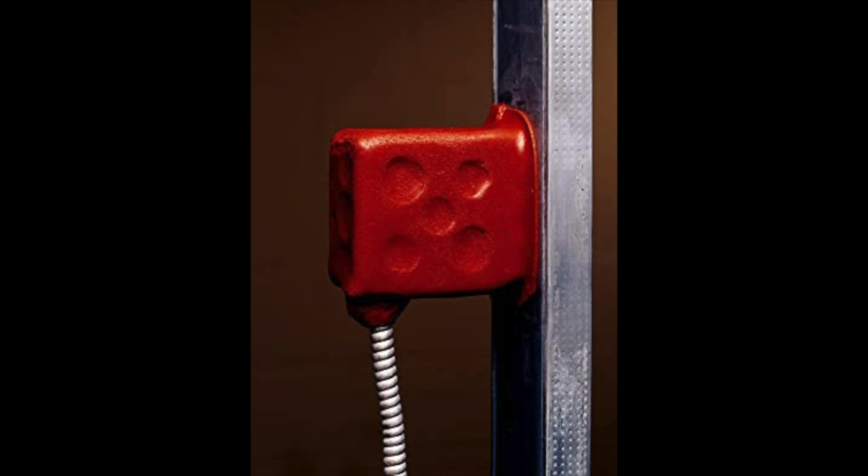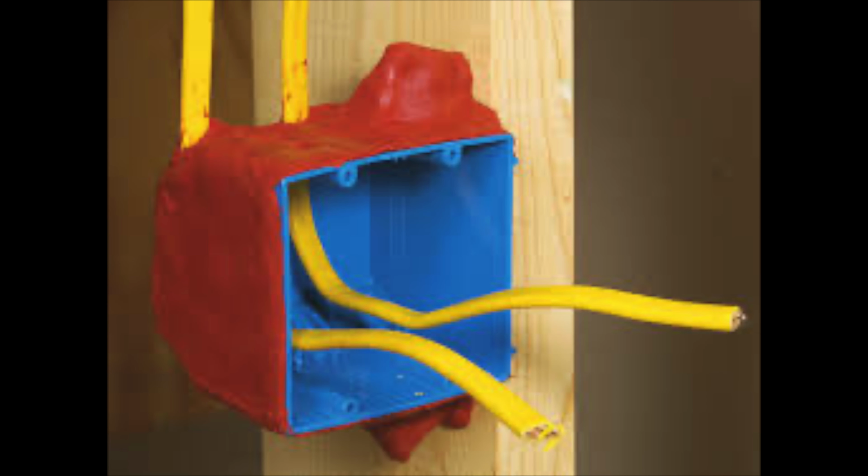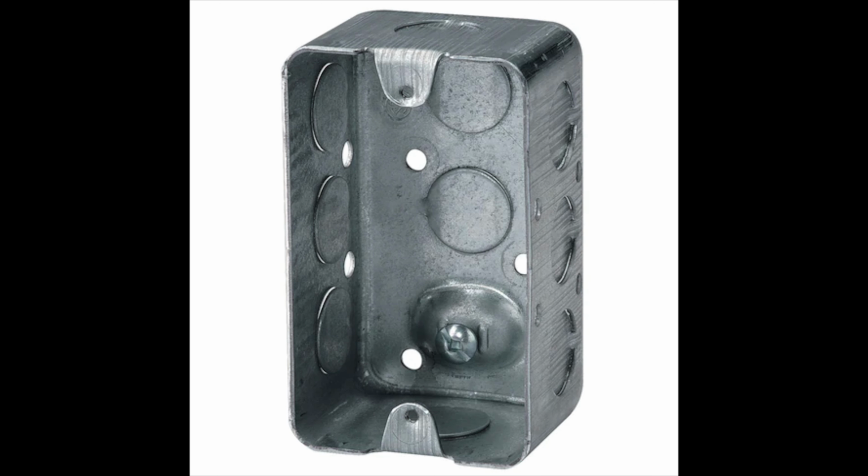And the first thing that you'll need to do is go right where your electrical outlet boxes are. And now that they're exposed, it's time to add some putty pad around the electrical box. This type of application was first invented basically for fire prevention, so that if there is a fire inside the electrical outlet box, the putty pad would act as a barrier so the fire wouldn't have time to easily spread throughout the house as it normally would. Thing is, it also acts as a sound blocker because it blocks all of those holes that are meant for different size electrical wires. So this is a cheap way to soundproof your electrical outlet boxes.